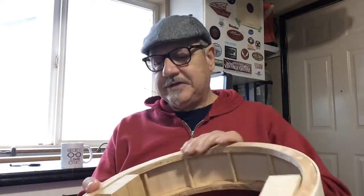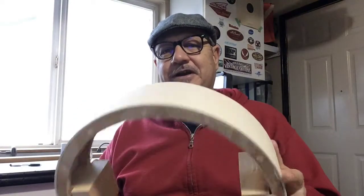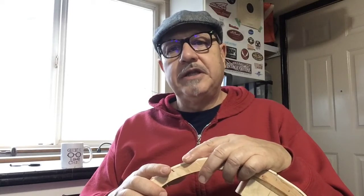Then the next thing will be making sure the veneer is sanded even. I give thanks to Tom Stimmerman who actually sanded all of this for me as a kindness, since I was busy and also a little under the weather. That's kind of how some of this build is going - I say here's what I want to do and he does it for me. So I'll be getting the veneer on, then gluing the boards for the top together, jointing the edges, gluing them to width so I can cut a circle out and get the top on.